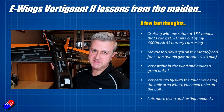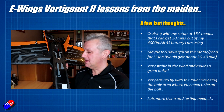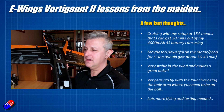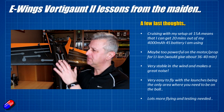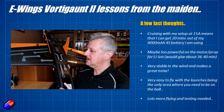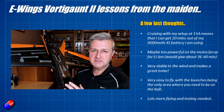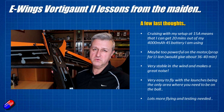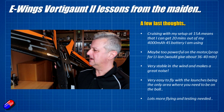It is very, very stable in the air. The weight of this thing, and the power when you have the right motor and prop installed, means that it doesn't care about wind — it just flies and floats, and it doesn't want to come down. It is really, really nice. It's very easy to fly and very forgiving. With throws of about 8mm up and 8mm down, that's all you're going to need, and it will give you easily enough to get in and out of trouble. Flying in manual mode and just poodling around, even cutting the throttle and gliding — it's effortless.